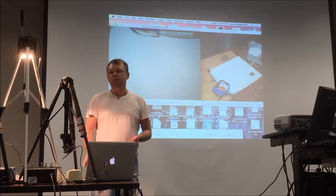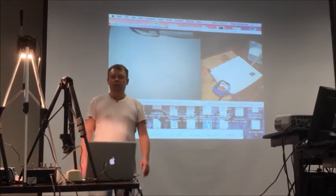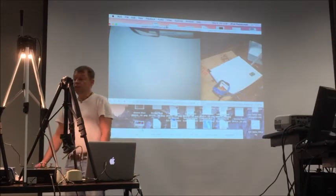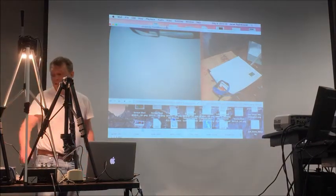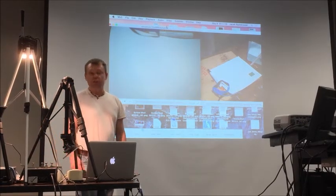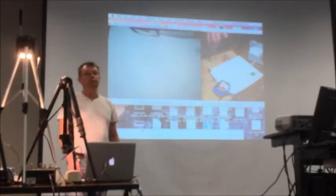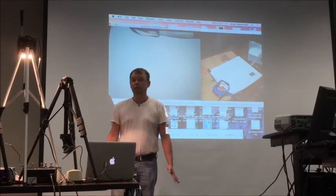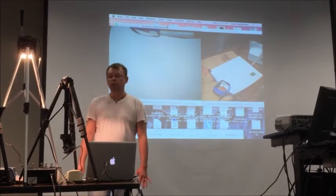The one tool that you must have is a good soldering iron. You should have had it a long time ago, so I'm not even gonna discuss it. A tool that I highly recommend is hot air. This is the station here. I'm not gonna lift it up and show it, because it will create too much mess, but you saw it last time. So these two tools are basic tools for pretty much all your surface mount devices needs. And most of the boards you will assemble using only these tools.